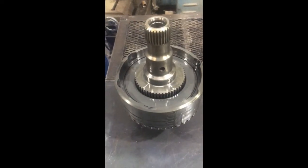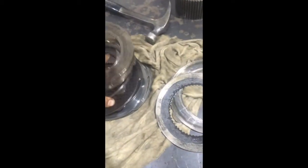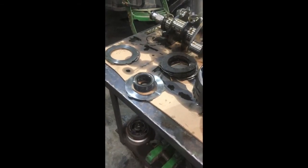There's a snap ring in here and these are going to slide out in pieces. Got the clutches removed and this was our problem — they are very shot. There's one that actually still has some pad on it, but a lot of them look completely worn. Found the problem.